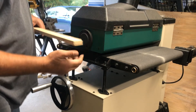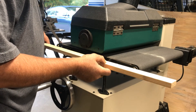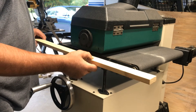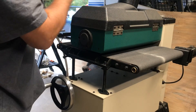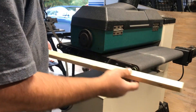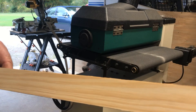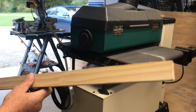The advantage of having the open end is if you had a board that was wider than 18 inches — I have some milled up live edge maple that averages anywhere from 24 to 30 inches wide. What you do is run it through, then take the unsanded end and run it through again to get the other portion. For 80 grit you can see some sanding lines, but it had no trouble sanding that down.